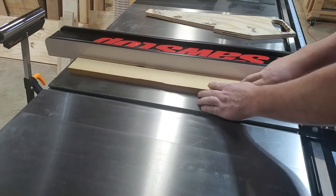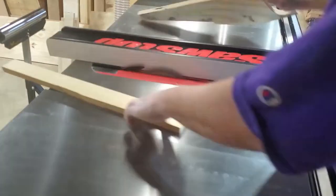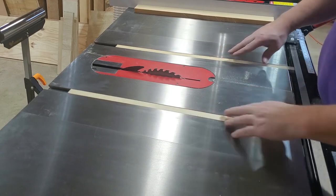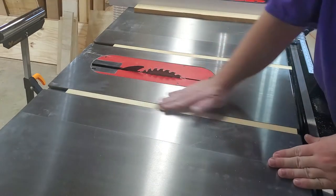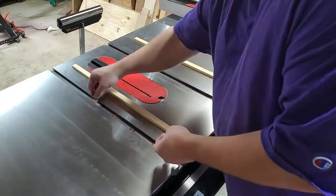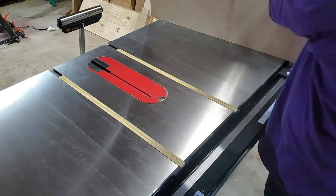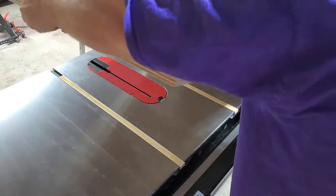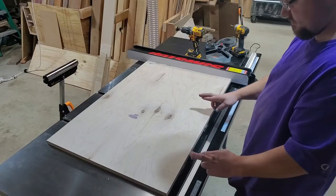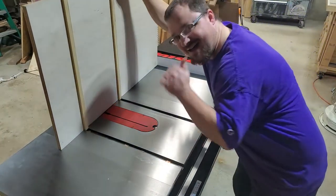Off into the milling process to make a straight piece of wood the same exact width as the table saw grooves. Then we'll cut off two strips that are a sixteenth of an inch shorter than the depth of the table saw grooves, so they fit in neatly and won't rub the bottom as the sled slides across. Let's try all that again — hopefully it'll go a little better this time.